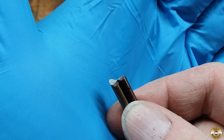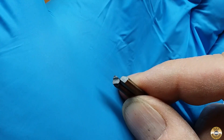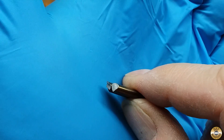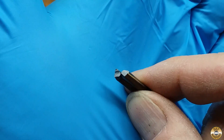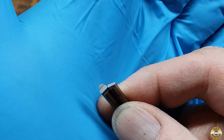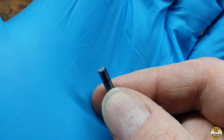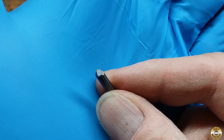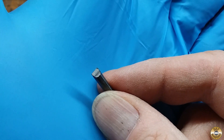The straw tempered piece is almost as hard as the quenched piece, so it will hold an edge well. The tempering process made it resistant to impact, increasing its toughness. This is an ideal knife temper. The blue temper trades some more hardness for increased toughness — it would be a good temper for springs, a flexible putty knife, or a saw blade.